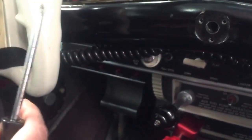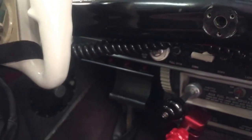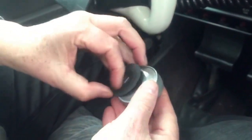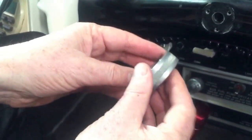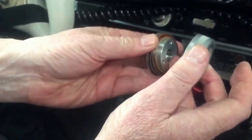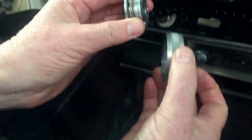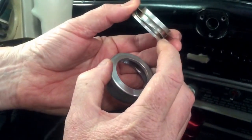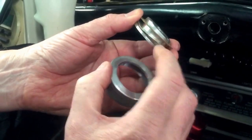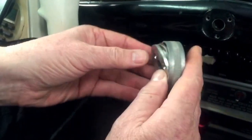Now we're going to put on the rear and mount this. Remember we've got three bolts that hold it on there, and inside the rear part — the aircraft side of the trim mechanism — remember there are two washers and a spring. They're essential parts of the friction mechanism.